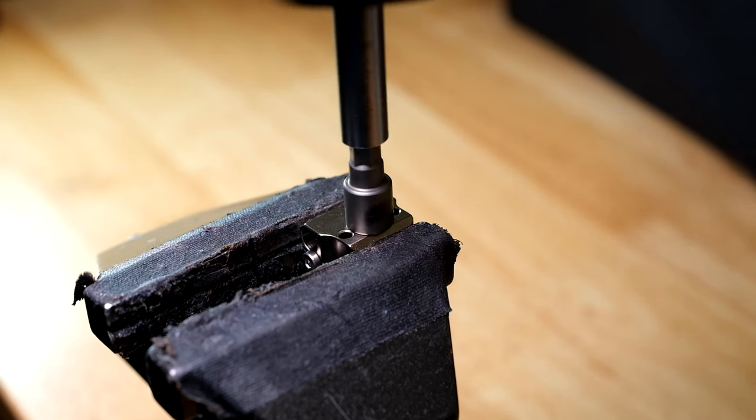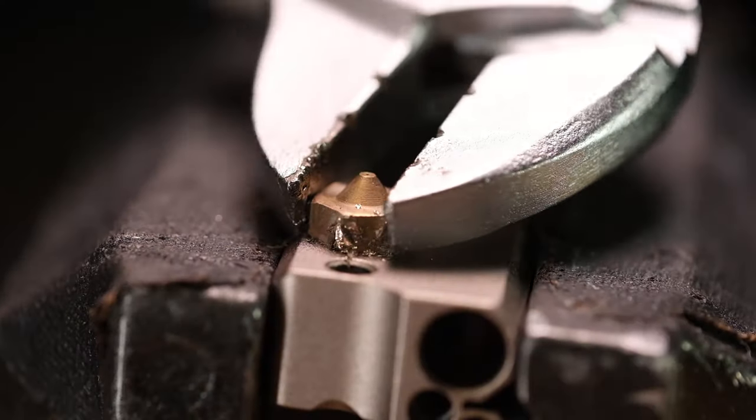On the flip side, tightening the nozzle too much can damage the nozzle or, worse, compromise the longevity and functionality of your 3D printer and hotend. When nozzles are over-torqued, you risk shearing the nozzle and damaging the hotend. For scientific purposes, I over-tightened brass nozzles in some old Mosquito hotblocks. Mosquito hotends can have nozzles tightened hot or cold, so I decided to hold the hotblock in place with a vice grip to demonstrate what a nozzle shear looks like, instead of doing this on a fully assembled and installed hotend.